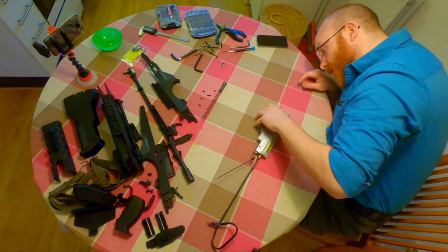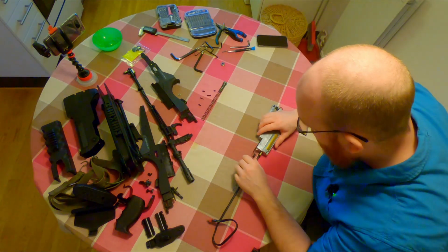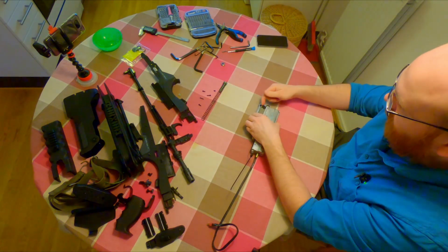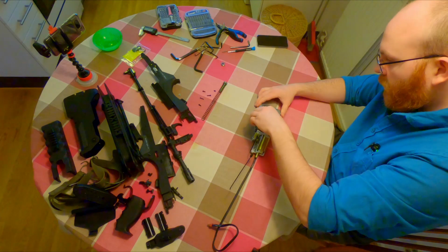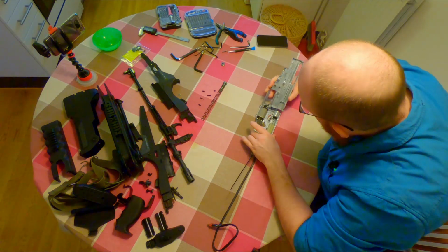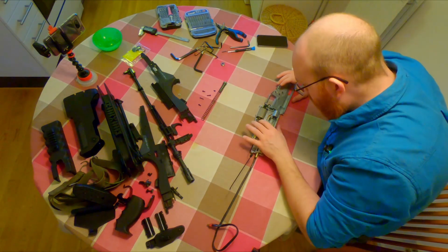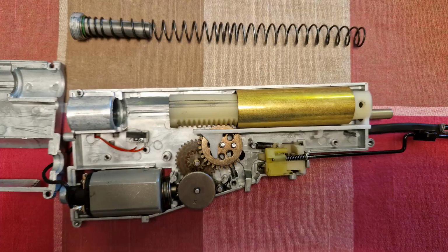Now can we open it? Yes. And there's this cable here, so don't rip it so you don't damage the cable. Just turn it over like this. And as always when you're working with gearboxes, you should keep track of your shims. So, working on this gearbox isn't really different from working on any gearbox, so I will stop the disassembly here.